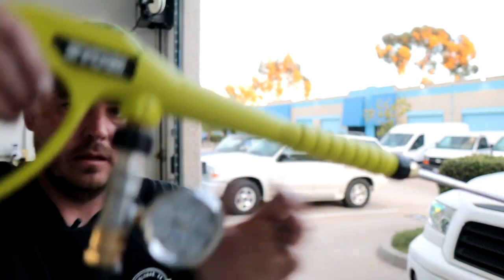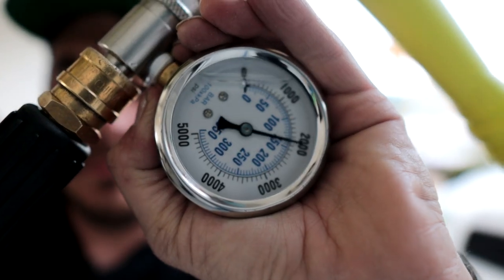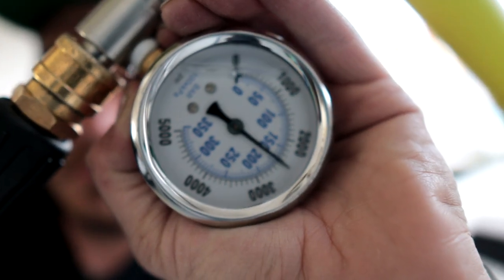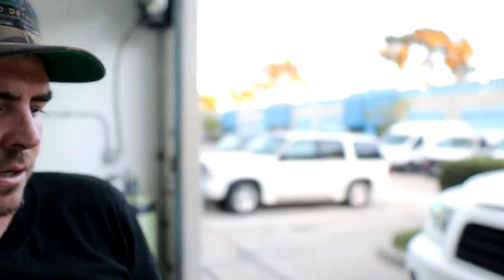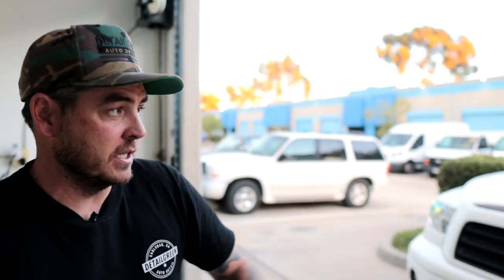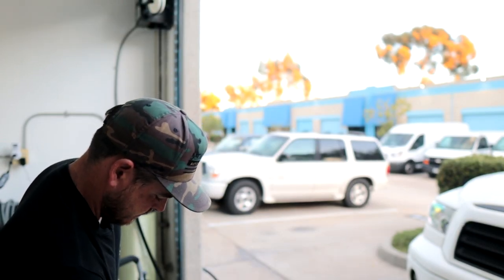Now testing the PSI rating on the 15 degree setting — I'm actually getting 2500 PSI, which is still a great number out of an electric pressure washer. Switching over to 25 degrees — the bad part about this dial nozzle is when you try to turn it, the whole thing spins with you, so you have to hold it in the back. Testing the 25 degree and then the 40 degree — same numbers across all three. Whatever the orifice size is in that dial nozzle, it's the same between each degree.